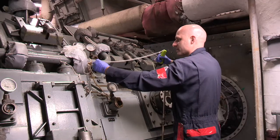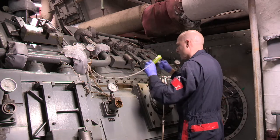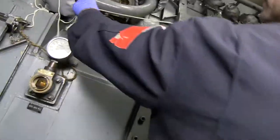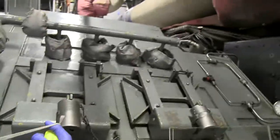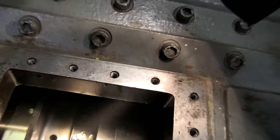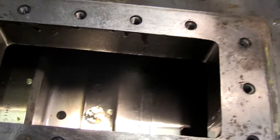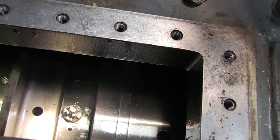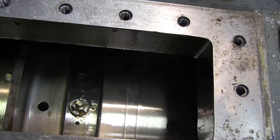We've opened the access to the clutch - again, make sure you move the cover clear out of the way. That fitting is what you're looking for; that's what the clutching tool is going to engage with. You want that dead center of the access panel so you have a little bit of room, and that just requires stopping the turning gear in the right spot.